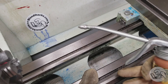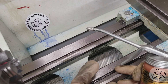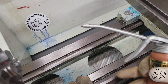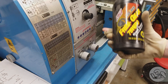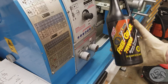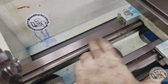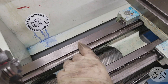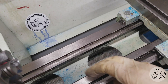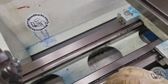Way oil is so useful it's kind of the go-to, when-in-doubt lubricant for machinists — it gets used for everything. A lot of machines specify way oil for change gears, gearboxes inside carriages, or quick change gearboxes on lathes. This particular lathe specifies 75W80 gear oil for the quick change gearbox and the carriage gearbox — a very typical high-sulfur gear oil like you'd use in a differential or manual transmission. Way oil also provides corrosion protection for machined surfaces that can't be painted. Check your manual for how often to re-oil, but honestly daily or every time you use the machine is fine — you can't really do it too much.